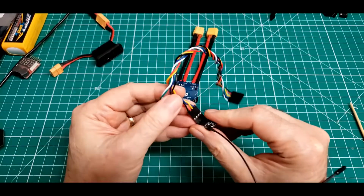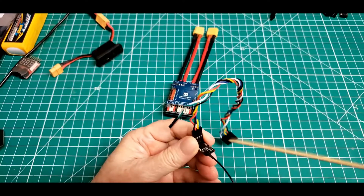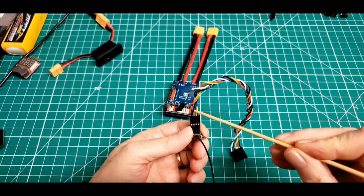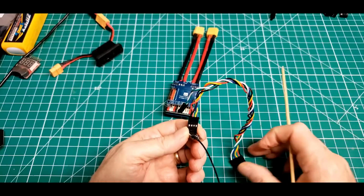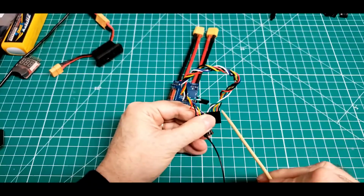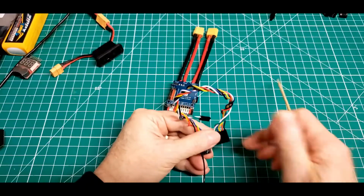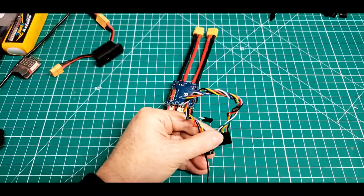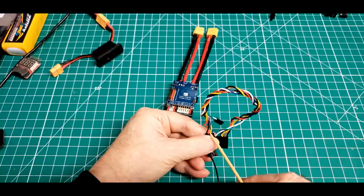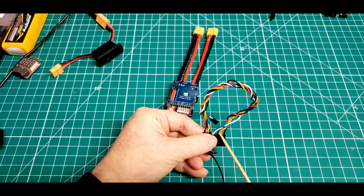So, physical connecting wires. Right here, I have a 4-pin DuPont connector on the first conductor of the Crossfire Nano receiver. Right here, black wire. I have set up for ground, and you can see on the other side in the connector's first wire I have ground right here. Next wire over is 5 volts, to supply 5 volts to the RC receiver. The next one over I have as a yellow pin. That's output 1. I have that right here, yellow pin.